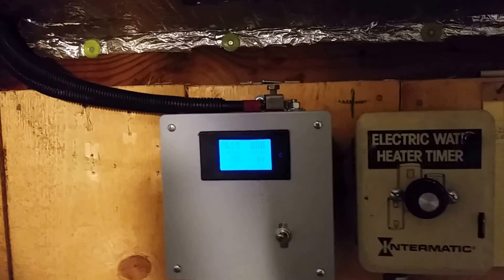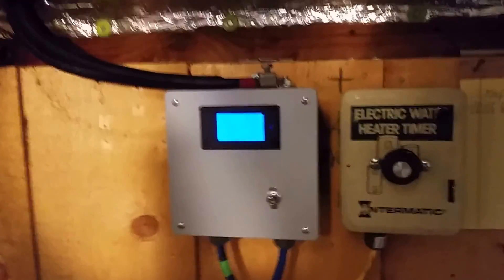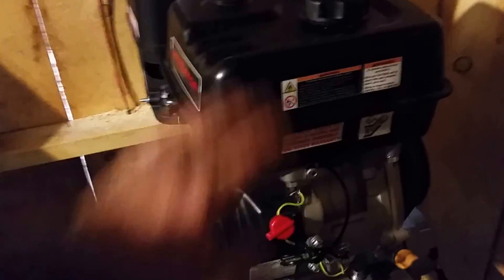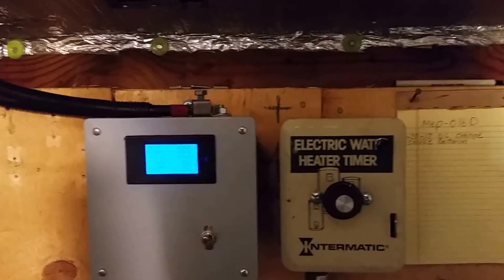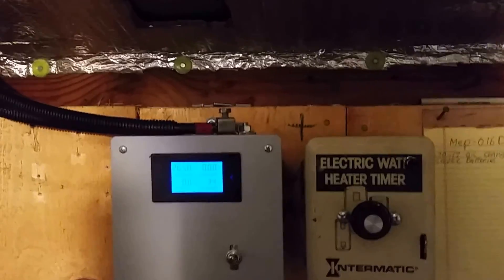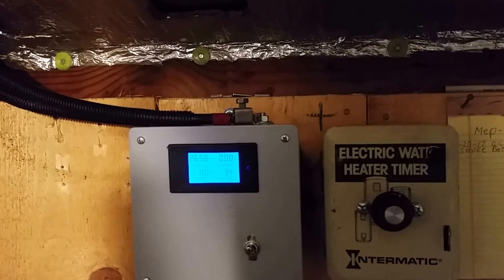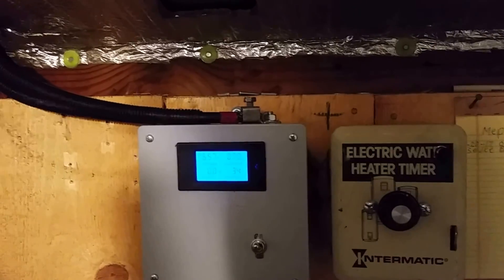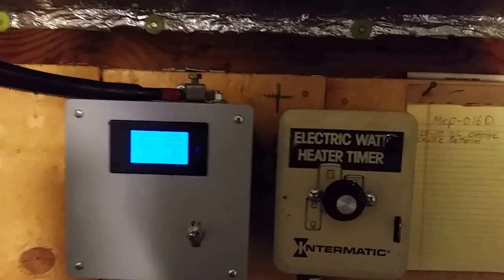So this is a manual way. Now what if I start this engine and I want to leave the house — I'll just leave that switch in and it'll all run automatically off the voltage regulator. Though I plan on getting a 130 amp alternator and changing this engine out to a diesel that I have — same bolt pattern, it'll bolt right in, pulleys and everything. The plan was: if I had quite a bit of solar through the day and was on my second or third day before a full 100% charge, and the solar got it close and then the sun went down or fog came in, I can light this motor off, pull this out, adjust the current, and manually finish my absorb.